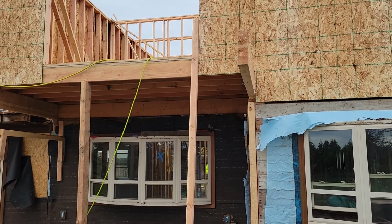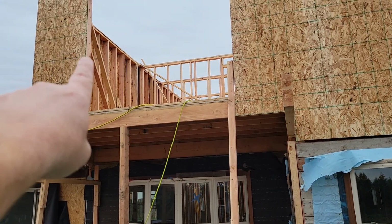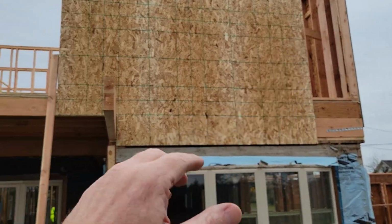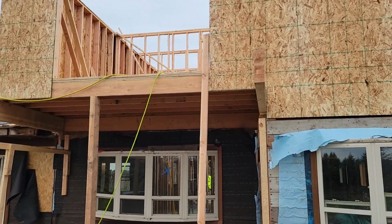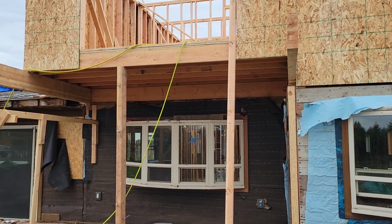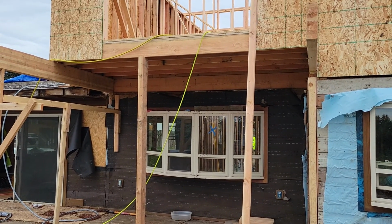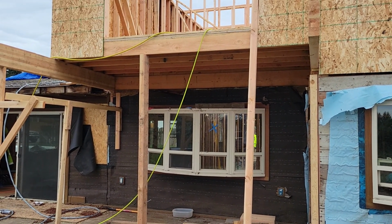It's an outside wall, but it's not bearing. We have the trusses going from that wall over to that wall. So this is a gable end wall, so it's not bearing very much weight. So that's our problem. We're unable to get the 8x10. We need to replace it with something else. What can we replace it with?